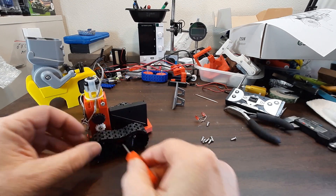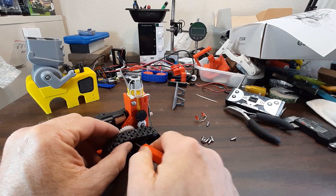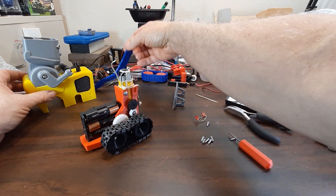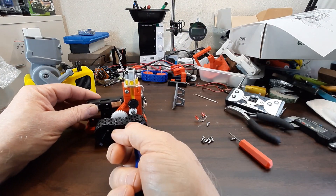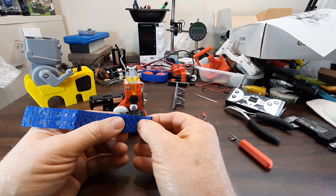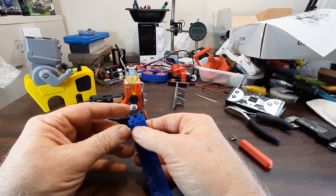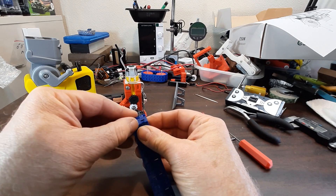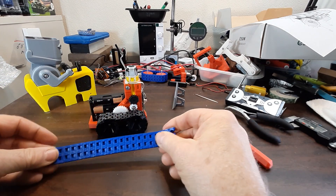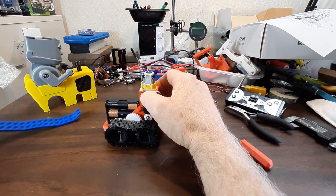The tracks came out a little loose compared to my original version. What I did differently was put some chamfers on the bottom of these to avoid a first-layer elephant foot problem. I'm leaving them a little loose because they work fine and don't come off. This one I printed on an Ender 3 at 0.2 millimeter layer height. I did have to crack every one where they were stuck together, then exercised it a little. I'm leaving it loose so hopefully it will be printable on any printer.